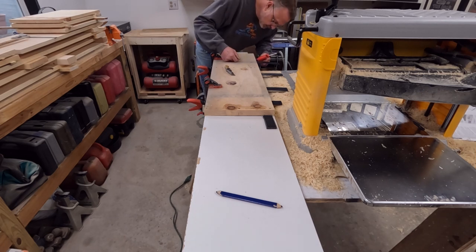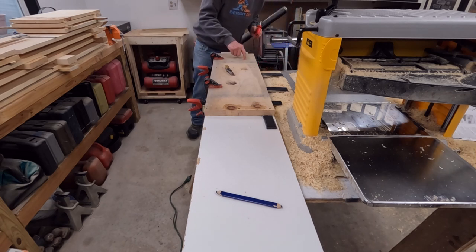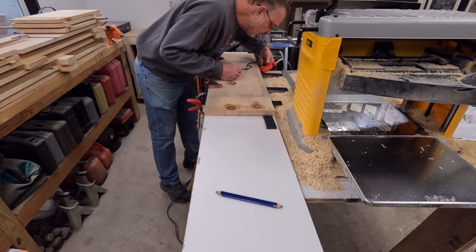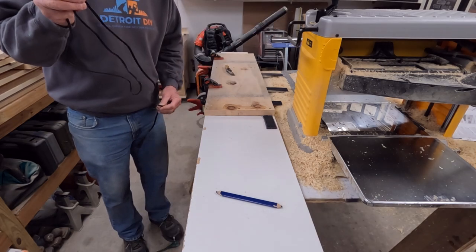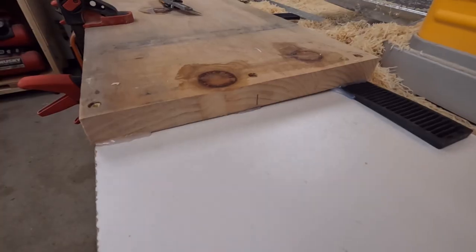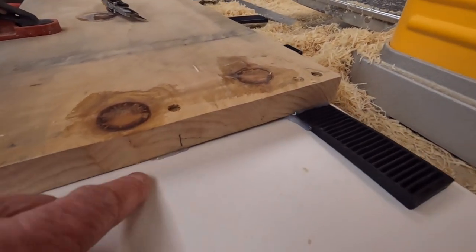On these side shims, I'm gluing the side shim to this board, and then I'm shooting some underneath on either side of the shim to lock the board to the sled and help hold the shim in place to the sled, not just to this board. With everything glued on, we're just going to let this stuff cool off for a little bit and grab a hold. The hot glue has cooled off and it's turned white and it has a good grip on things.